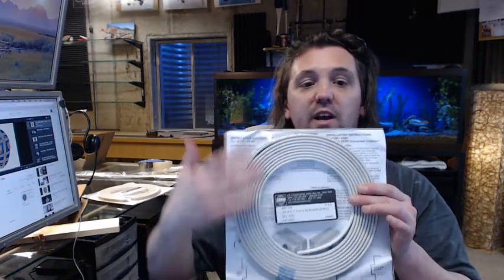There are instructions included with this package. There is also a link to the product brochure below this video showing everything important about it and its related products, as well as a link called mounting drawing which contains the installation instructions. The most important thing is that the frame is clean and free of any debris or dust. If the frame has been recently painted, make sure the paint is fully cured — you don't want to have to redo this. Clean it with an alcohol swab, which will evaporate off and remove all the dust, so you'll be able to get the material installed very well.